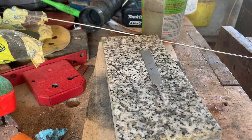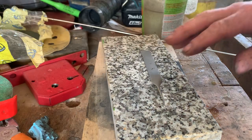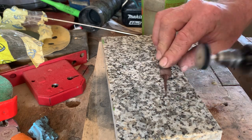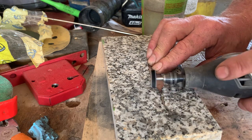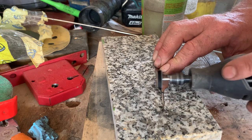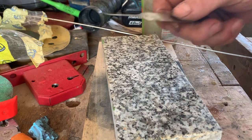What we're going to use next is a little felt polishing wheel on a Dremel. Get plenty of fine paste on there. Keep this wet still — keep it pressed down onto the granite, which helps dissipate the heat. Dump it in the water again. You only need to go up to where the handle starts. Don't keep the polishing wheel in the same place. And I think we're pretty much done.